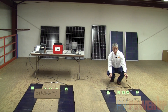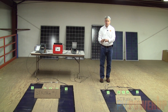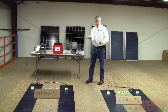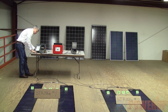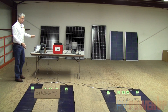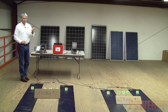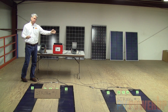In our kit we also give you enough conductor to get from the roof down to your inverter. From that positive and that negative, you have polarized connectors to connect them up, and then you have to run the conductor all the way back down the roof to the DC disconnect. We provide one loop of conductor and you make the cut at the point you need, because we don't know if your positive is closer to the inverter or the negative.